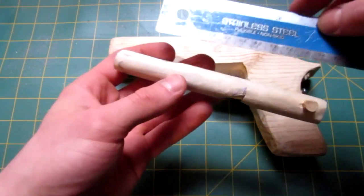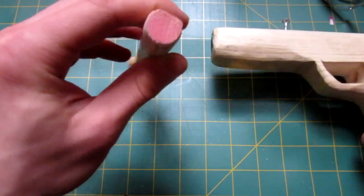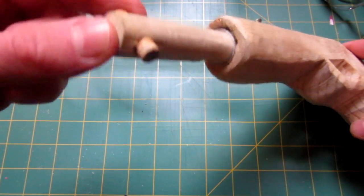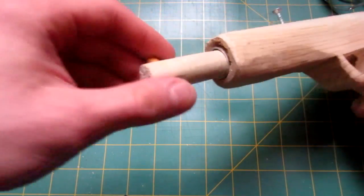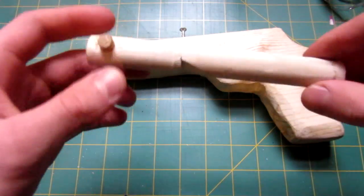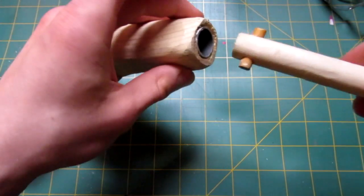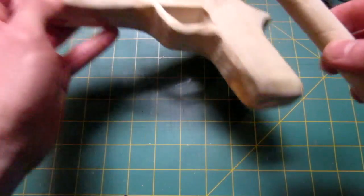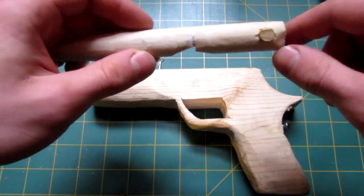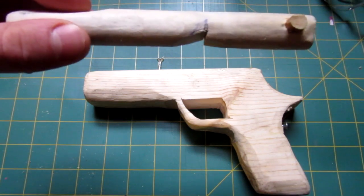Now, to make your dowel. I have a dowel here that is around five and a half to six inches long, and it is the proper diameter — I believe around a half inch to five-eighths, maybe. It nicely fits inside the barrel but doesn't wiggle around too much, because if it wiggles around too much it could get caught, but if it's too tight it obviously can't slide very nicely. You need to do two things: first, drill a hole in this end and put a smaller dowel through it, so the whole thing can't slide down the barrel. And you also want to make a notch — with the doweled side to your right, make a notch straight up and curved just like that, and that'll be for the trigger assembly.